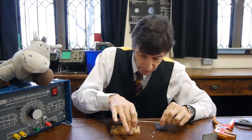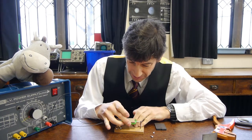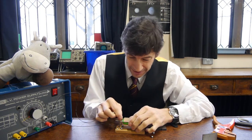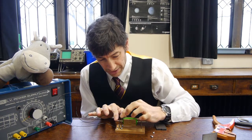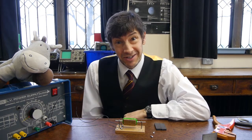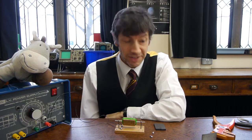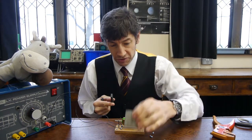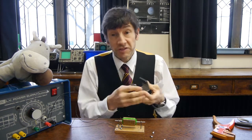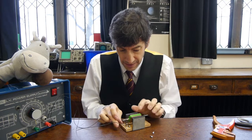I've got the brushes in place, here's the rotor, so I'm going to put it back on its little bearings and stand. The technique — I nearly forgot — was to lift the end of the motor up like that and pass the rod through the middle. On a good day, what I've got is two springy brushes touching the end of the bare coil ends, and we'll see if those will connect up and the motor will start. Now, the more observant amongst you will notice there's not a hope this will start yet because we haven't got the external magnetic field. So I've got something to hold the magnets in a horseshoe shape — there's the first one and here's the second one. I'm being really careful to make sure north and south poles are facing each other so there's a magnetic field across the gap. Shove the little motor inside — just going to check it freely rotates.